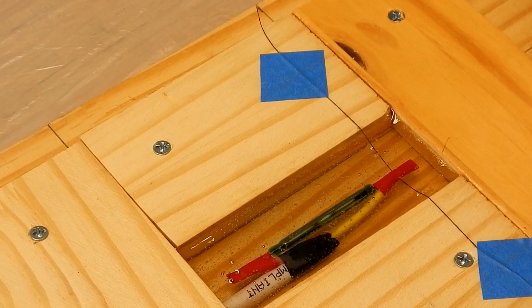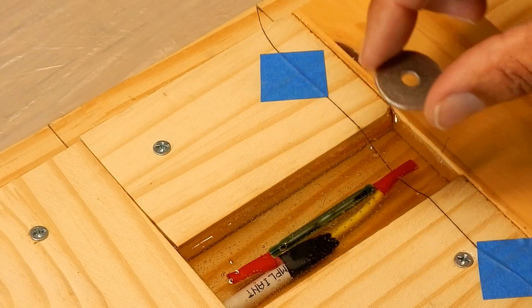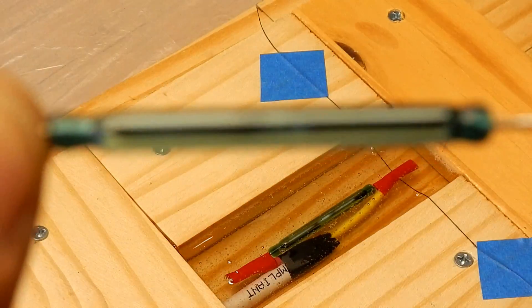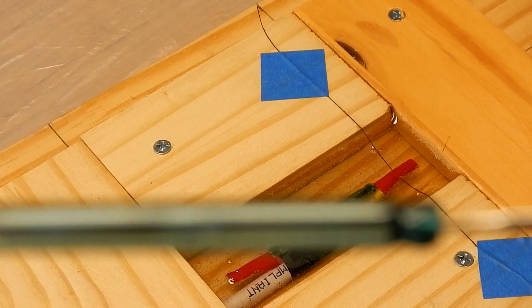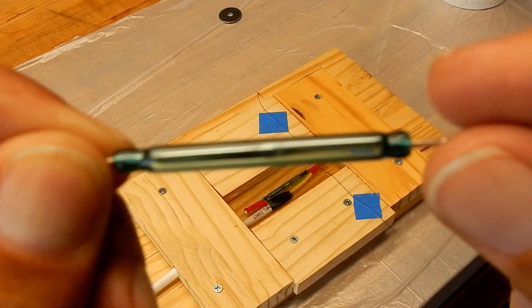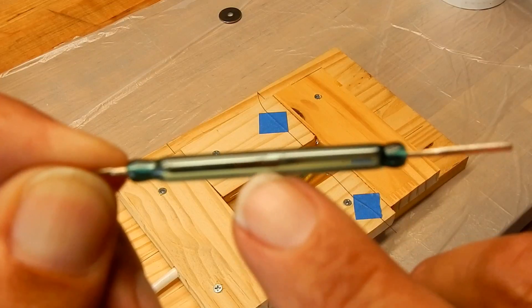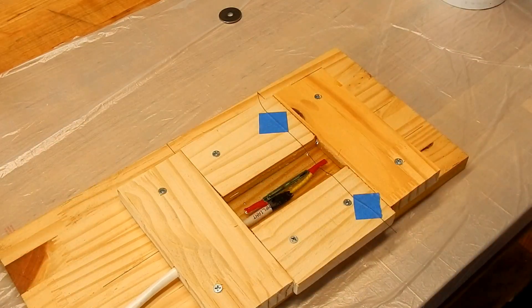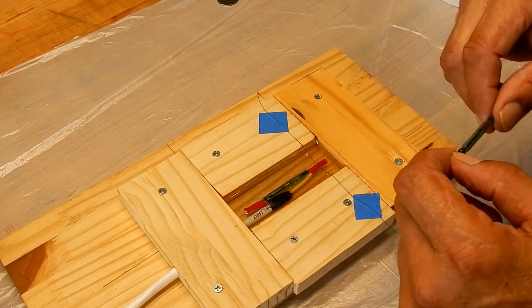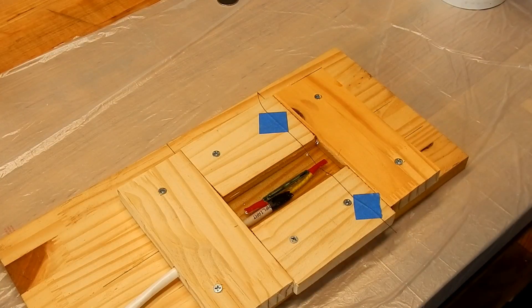I'll pull the string out once it stiffens and carefully lower the washer in, trying to center it right over the reed switch gap so the magnet will align there. I put a straight edge across to check it's parallel. I'll leave enough room to sand it down for a nicer fit under the deck. I bought two reed switches in case this doesn't work — I can always switch to a lighter-weight switch with a relay.